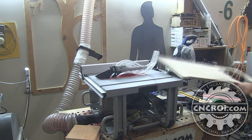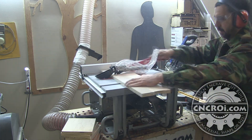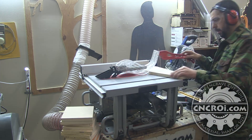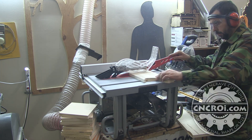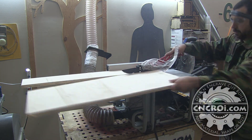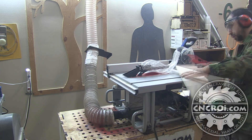The first tool I considered for this project was the CNC router, but the main reason I chose against it is material waste. With a table saw you're removing maybe not even one eighth of an inch of material, while with a router you're probably using at least a quarter-inch bit or larger diameter. That extra material just becomes sawdust, so using the table saw was more efficient — no programming needed and very little dust created during cutting.